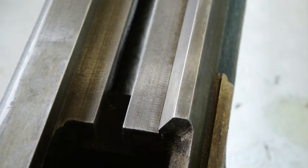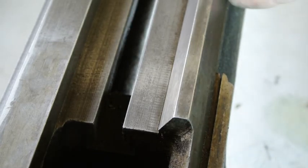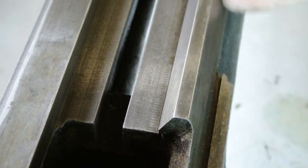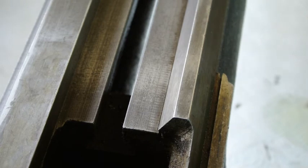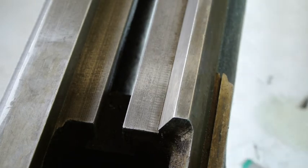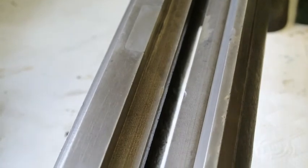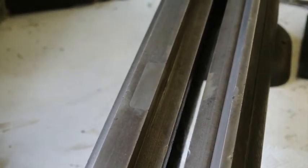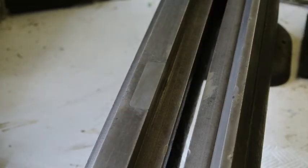On the V here there's only a tiny bit of wear on the side. On the outside of this V there's very very little wear — just a touch, but nothing to worry about. So all told this is actually quite a nice lathe and should produce some nice accurate work for years and years yet. So that's finished now for the moment. That little patch I put in really is hardly visible even on a quick look, so I'm well pleased with that.